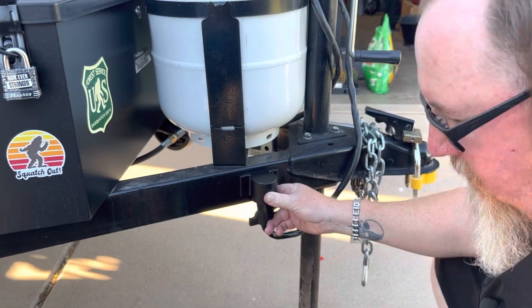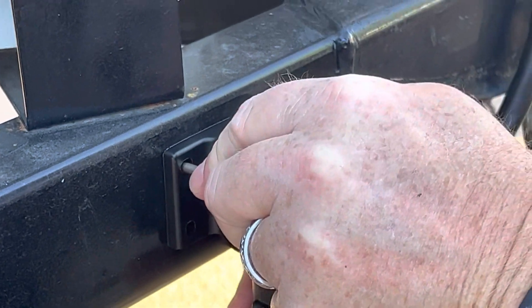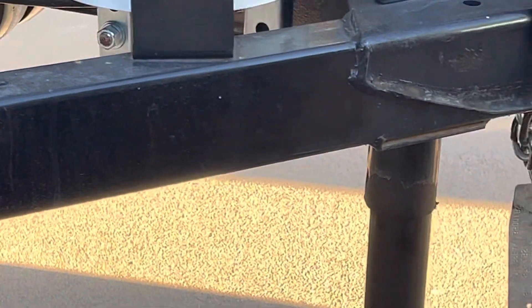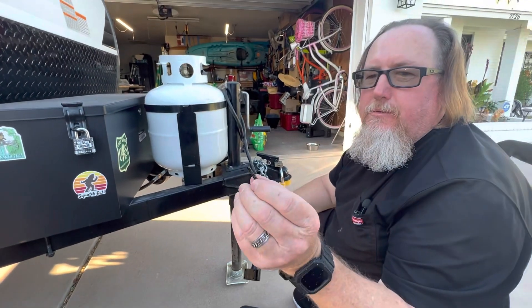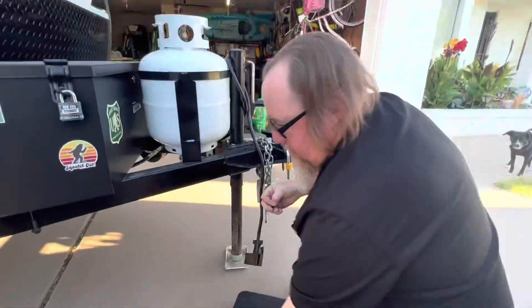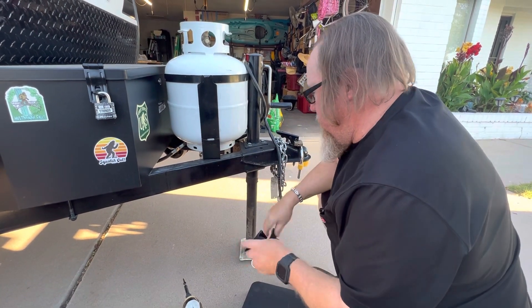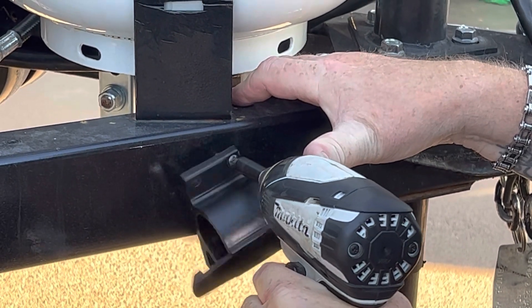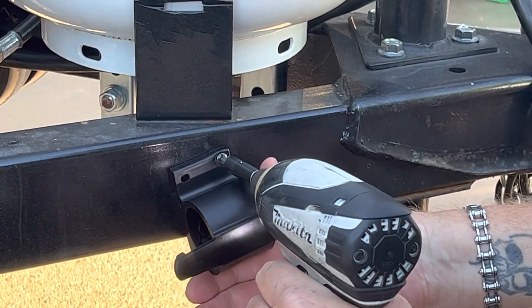You don't have to, but I like to make sure things go nice. Let's do one center punch hole. A couple of punches and, as you can see, it makes an indentation of where your mark is going to be. Open the package — the self-tapper screws that came with it use a standard Phillips head. Put it in there where you have your mark and drive it in.